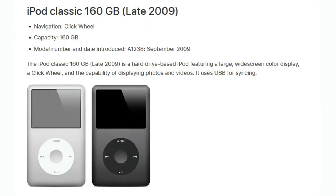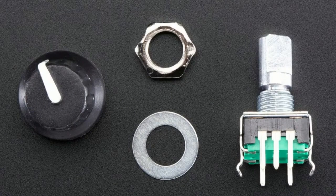A lot of people know rotary encoders — they've been around for a bit. I think the iPod Classic is what a lot of people think of when they think of rotary encoders. The most common rotary encoders people use are the PEC 11 style. These are five or six-pin mechanical rotary encoders, very inexpensive — like a dollar or two. They solder directly into the PCB and have a little D-shaft knob. As you twist them, the common pin gets connected and disconnected from the two side pins in a gray code. By keeping track of these pulses, you can tell whether it's going forward or backwards and how many times it's been clicked.